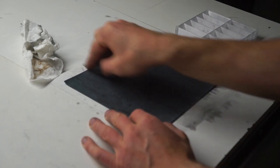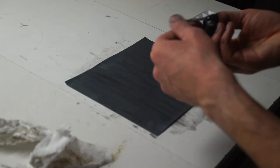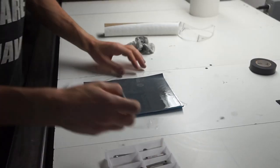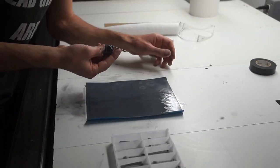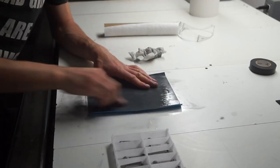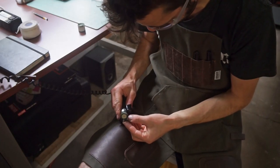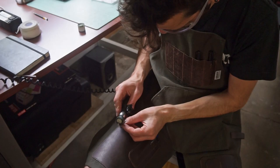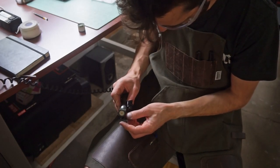The first step in this whole process has nothing to do with plating. These are the titanium pocket clips that I put on the pens. I want to bring them up to a pretty nice finish for the anodizing. The brighter the finish, the better the anodizing pops. After these are machined, I run them over some, I think this was 600 grit wet sanding, just to put a nice satin finish on them. After that, I run them through buffing, once again to bring the finish level up nice and high so that when they do get anodized, they shine quite nicely. Titanium can handle a much higher finish without scratching just because it's so much harder.